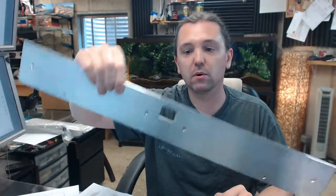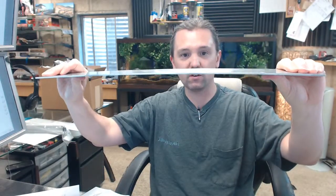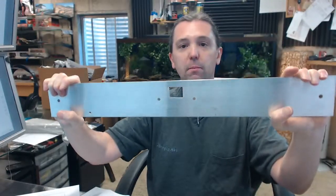Other ways people have installed this: we have built frames for people that have an applied stop, and we have routed the back of the stop an eighth of an inch to fit this in. Getting this material installed behind the frame, especially with a lock bolt going into it — you can see there is a punch there for a lock bolt — gives the would-be attacker a significantly greater obstacle to kicking it in. The door frame reinforcer can be bent fairly easily one way, but there is no way to bend it when it is like this. That is the face presented to the door operator.